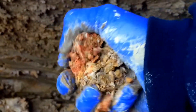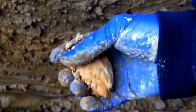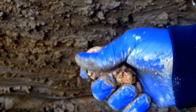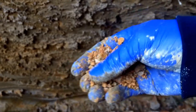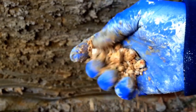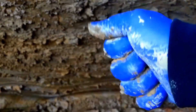Take some of the real red stuff — break it, crush it — see, the red just crumbles and falls apart. The gray helps it hold together a little bit. That gray sticky consistency tells you that when it gets wet and then dry it's going to be more prone to expansion and contraction, whereas the red is pretty much going to hold its shape all the time. For a real good pad you'd really want good red because it'll compact but also allow permeability to let water through, so it doesn't shrink and swell as much.